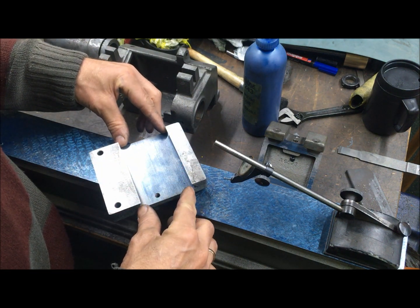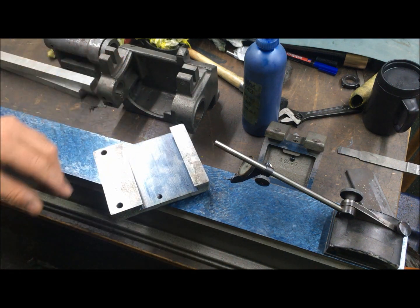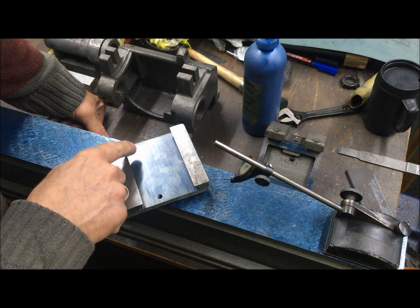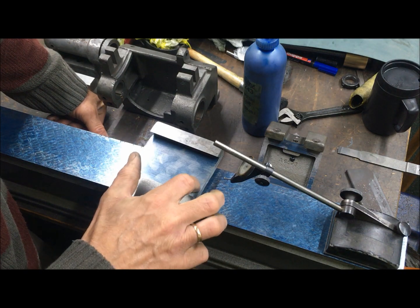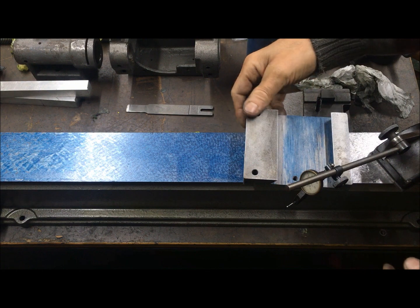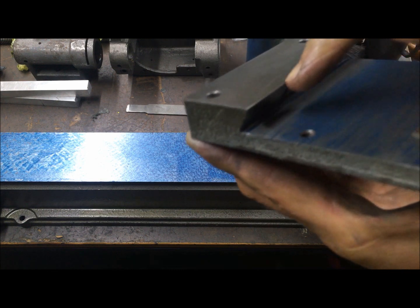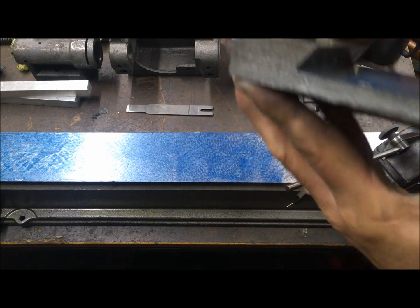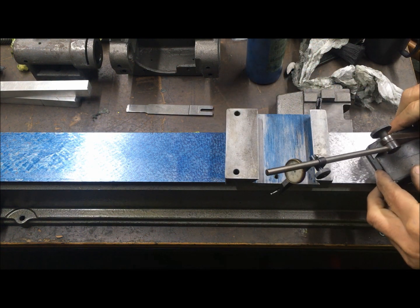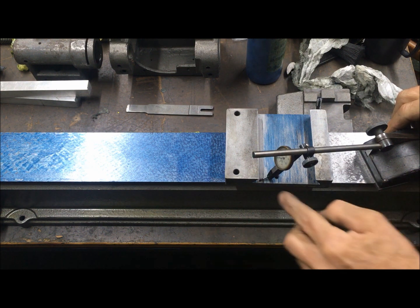What looked the flattest or least worn is actually just normal wear — dropping here on this side. Now I found a ridge here along the front side, so I know this is now representative of the pristine surface, and that this area here is worn.